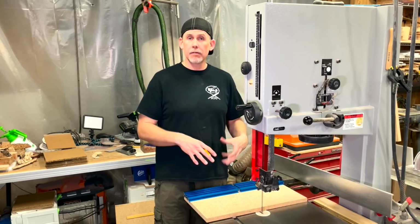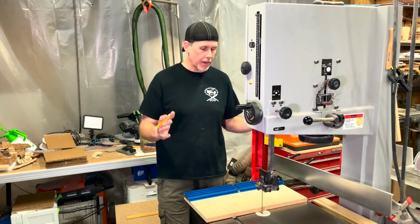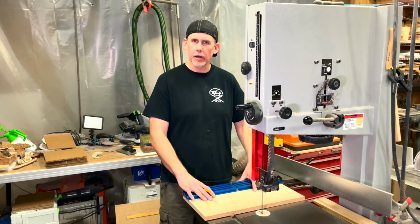It's nice, but it's also really rock solid, tight on here. I'm not going to have to worry about those hold downs ripping screw threads out or anything like that. Pretty happy. It's pretty nice. It's nice and hefty too. The aluminum plus the particle board compared to the MDF is all much heavier. So it just feels solid on here. I'm super stoked. So at this point, all I got to do is make my zero clearance cut.